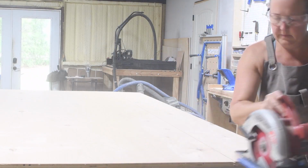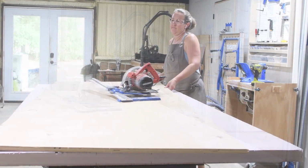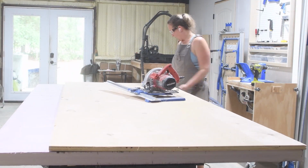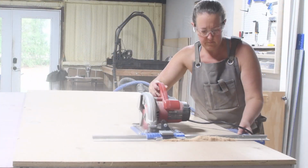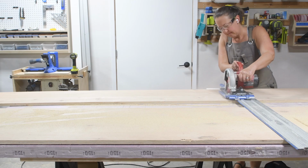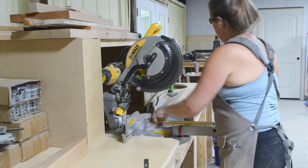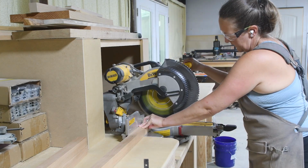To start, I cut out all the plywood pieces according to the cut list in the plans that I'll link in the description below. To cut the plywood out with my circular saw, I placed it on a piece of rigid foam. Then I ripped the sheet down into strips with a rip cut guide before using the AccuCut guide to cross cut out the pieces to the finished length. The rest of the pieces are from 1x2 and 2x2 boards, which I cut to length using my miter saw.